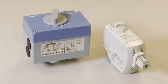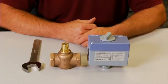The 599 PowerMite MT series valve body will accept both the SSC and the SQS series of electronic actuators. Which actuator is used depends on job requirements. The assembly of the SQS actuator to the PowerMite valve body requires minimal tools.